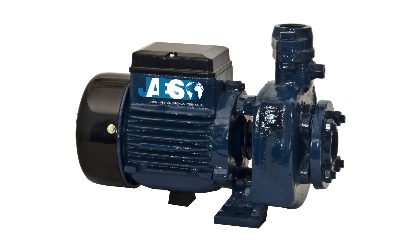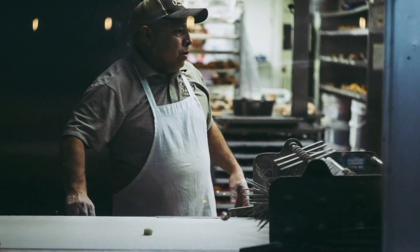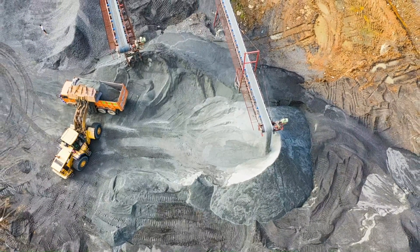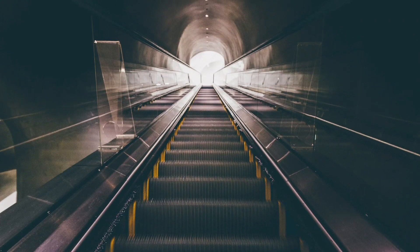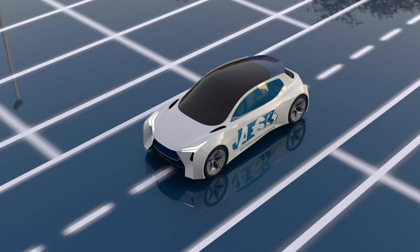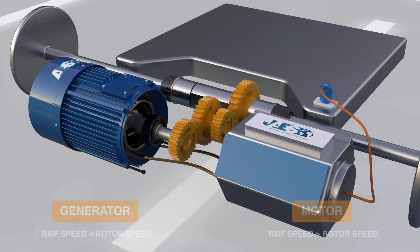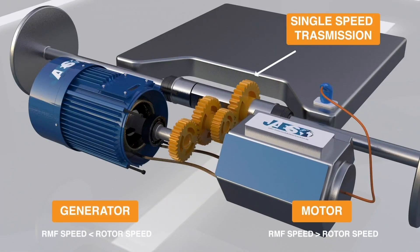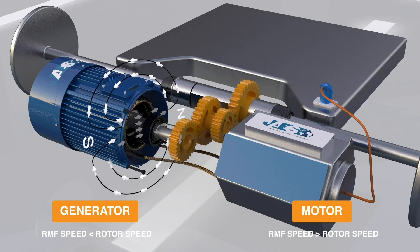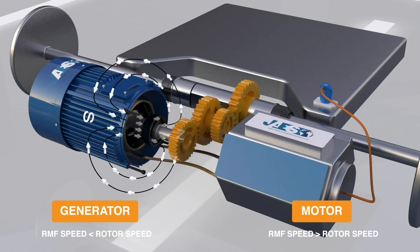These features of the induction motor make it suitable for use in a wide variety of industrial sectors such as food, chemical, metallurgical, or wastewater treatment plants. It can be used in lifting devices such as elevators or hoists, and in transport systems such as conveyor belts and even in electric cars. Induction motors have a high speed band, which is why electric cars have a single speed transmission. Furthermore, an induction motor can also act like a generator when the rotor is moved by a prime mover. This is possible only if the speed of the magnetic field is less than the rotor speed.